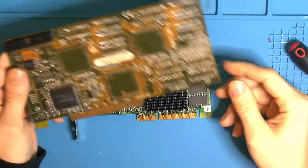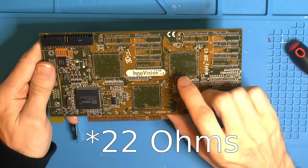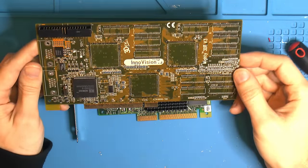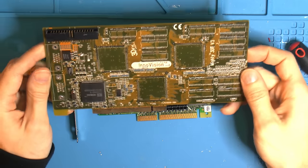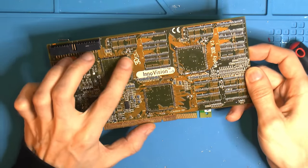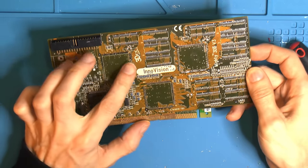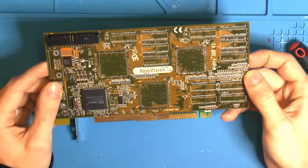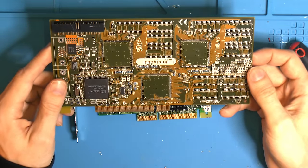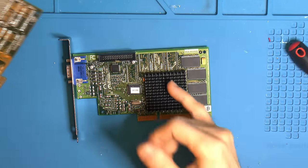For parts, I don't have 39 ohm resistor arrays, but I have these 47 on this VT2 PCB from an older video I did a few years ago. You can probably see it here, but someone ripped off the whole TMU and took most, not all, but most of the pads with it and a lot of the traces. So this PCB is really difficult to repair, there's no point in it really. So I think we just pick parts from this card for what they're missing on here.